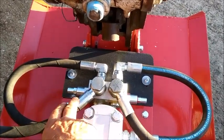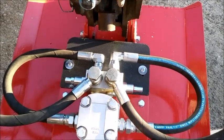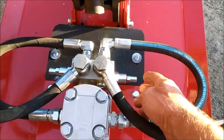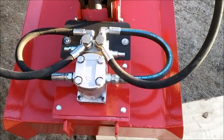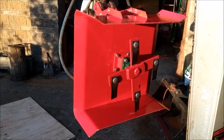This pressure relief valve sets the max pressure to the motor. And this valve I've modified to act as a one-way valve for the overrun when the hydraulic pressure is released. Initial test after installation.